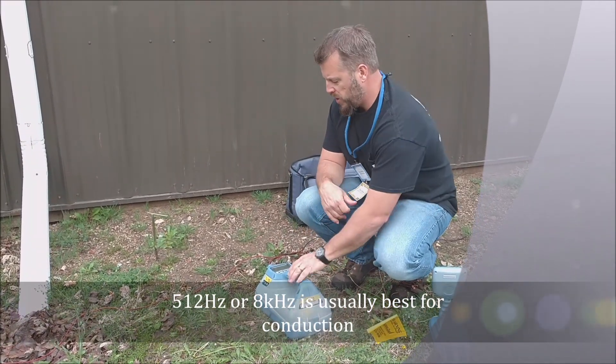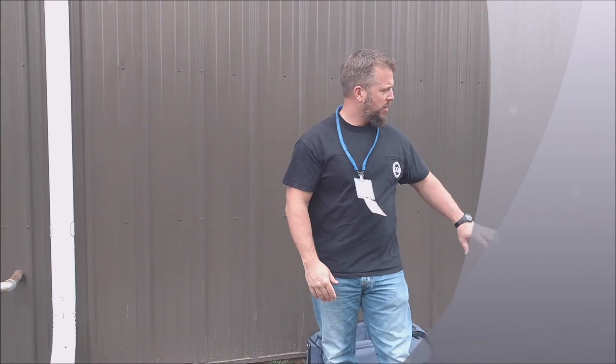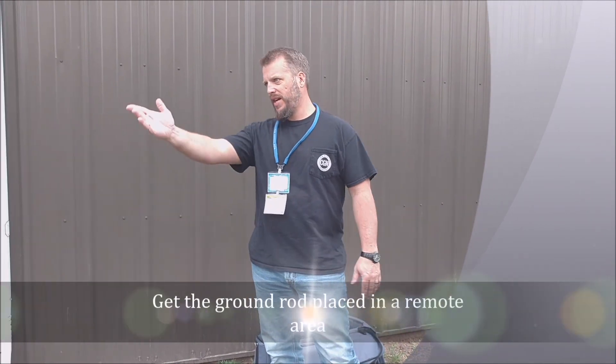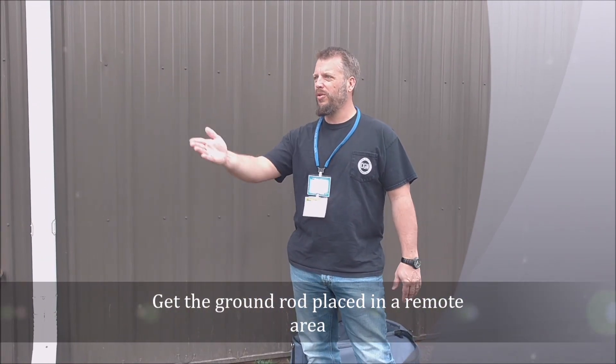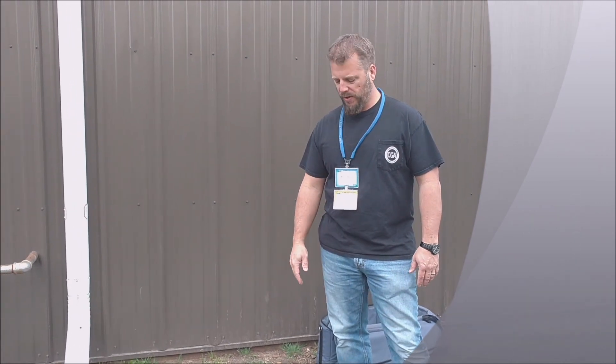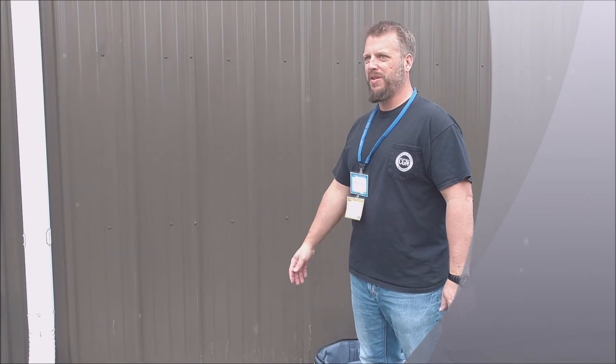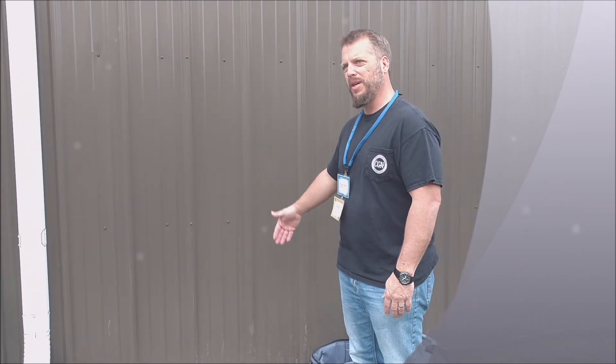When you hook up, you want to get the ground going in the opposite direction of where you plan on going — they usually say a 90-degree angle. I just get it off in this direction because I can see the flags are headed over this way, so I assume we're going to be locating in that direction, so it's away from the receiver and not going to give you interference. You also want to try to get the ground away from steel buildings like this, because they just like to suck a lot of signal into them and really confuse your locator.